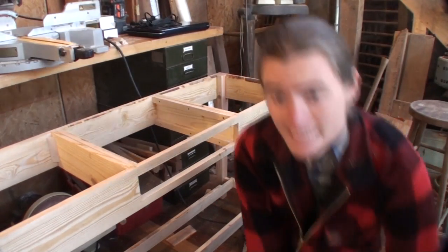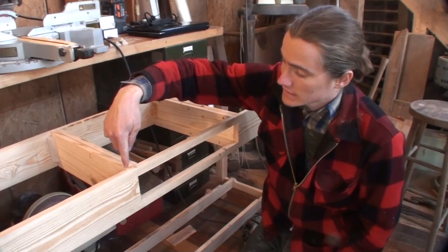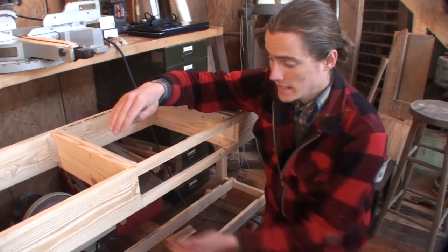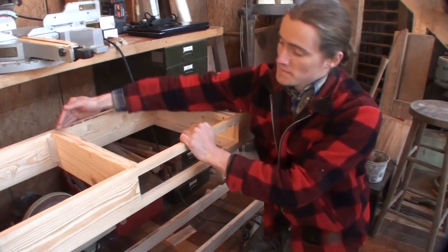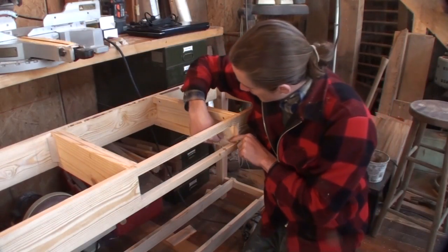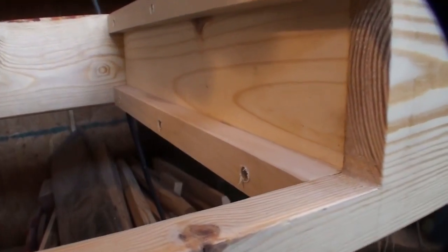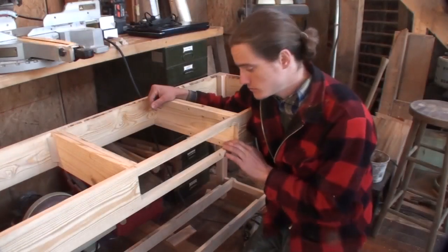As for how the drawer sits in the piece, I took pieces of wood the same dimensions as the apron and cut stop dados down the insides of the apron. I cut a rabbet on the piece so it slides down and bottoms out on that dado — you've got downward support plus an actual joint between the front and back aprons. That joint was further locked in with 45-degree glue blocks glued and shot in with brad nails. The drawer rides on drawer supports — three-quarter inch by one-inch pieces of wood — as thick as the bottom part of the apron. Those will get waxed up, as will the sides and bottom of the drawer, for a smooth-riding drawer.